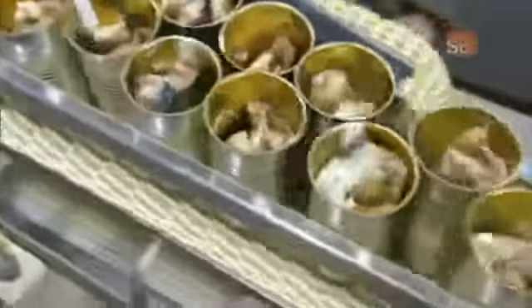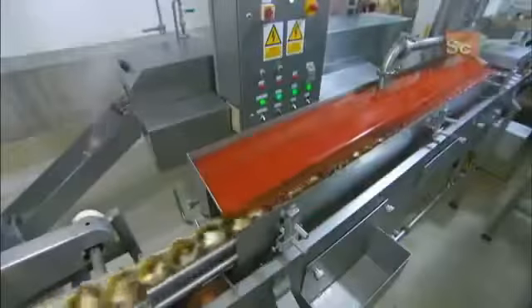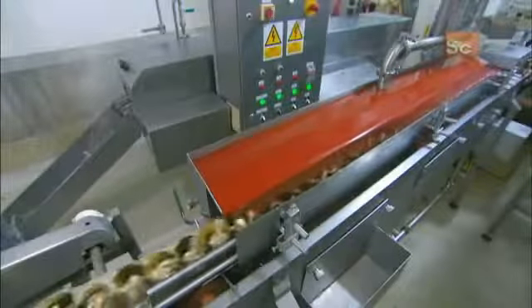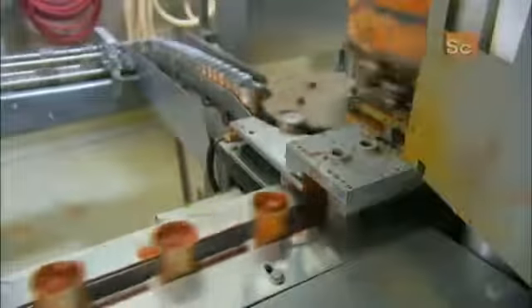Depending on the product, a filling machine treats the sardines to oil or a specific flavor of tomato sauce. The filling machine overfills the cans with sauce, but a flute hidden inside the machine removes just enough sauce to put the lids on properly.